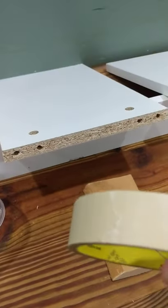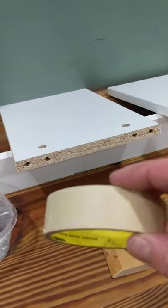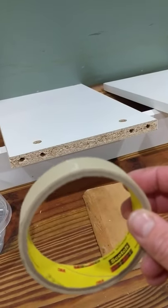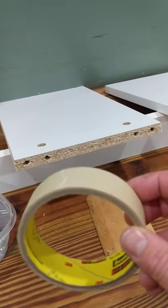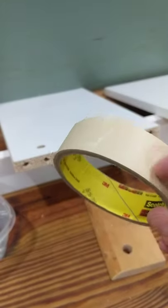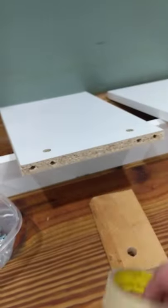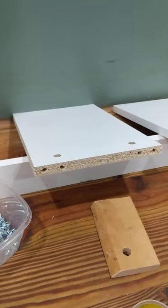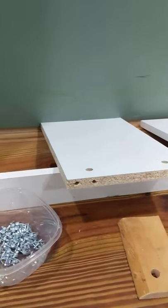I did tape it. I read that putting some masking tape over your cut line can help to keep everything from splintering. And I guess it did — it didn't splinter badly. Also, having a new sharp blade makes a huge difference. This masking tape is actually see-through, which was perfect. So I drew the line on the board, popped this on top, and then could just cut right down the whole width of the board for a nice clean cut.